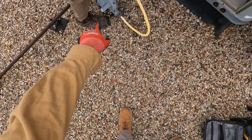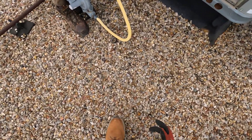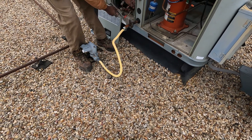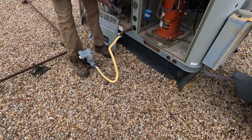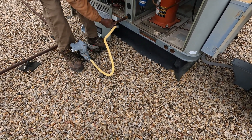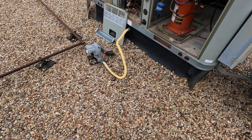Taking the gas line off — we got the gas line shut off right there. A lot of times when you're doing this you got to hold backup, but since our 90 and our burner line is the back-up, you just got to be careful — don't put a lot of force on it, just ease it out of there. You got to hold the back-up pipe. Whichever way you turn it, the other pipe you got to go the opposite way — that's called backup. Most companies call it holding backup because if you don't and you go to twist it, you might bend something that's crucial. Always hold backup when you're doing piping, even with copper.